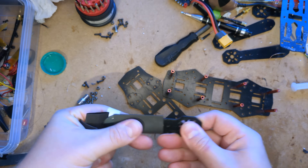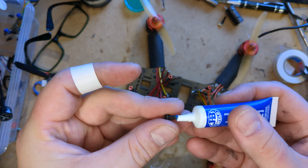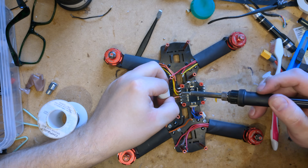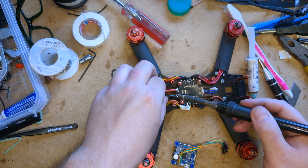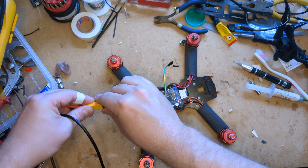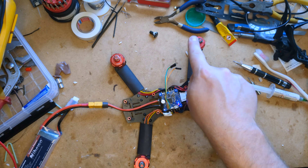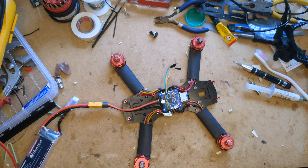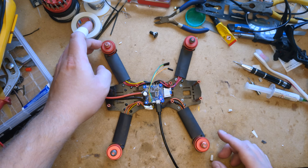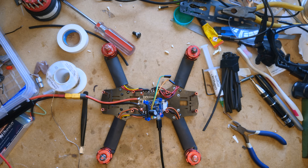After scraping off all the sticky foam, I put some heat shrink tubing around the propeller arms so I could run the wires for the motors through them and keep everything neat and tidy. I also thread-locked the bolts for the motors — I've made that mistake before. Next I soldered the motor wires and battery to the ESC, and attached the flight controller to do some initial motor tests. We can now make sure the motors are turning in the correct direction — these two turn anti-clockwise and these two turn clockwise. Everything except motor 2 is wrong, so that's a lot of wires to swap. Luckily all you have to do to reverse a motor's direction is swap any two of its wires, so getting them turning the correct way didn't take too long.